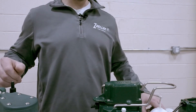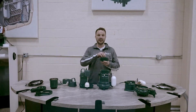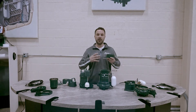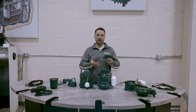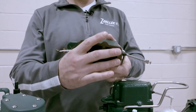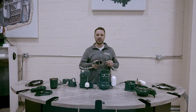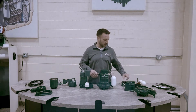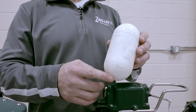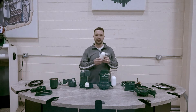When we move over to our Model 53 and our core product offering, we use a fully cast iron cap, acting as one large heat sink. As the pump generates heat, it draws that heat from the motor housing up into the cap, and the water around the pump cools that cast iron very efficiently. We also utilize a snap action switch that we've been using since the 80s — tried and tested over a million cycles. This switch is inside the cap, out of all the elements. On our core product offering we also use a solid polypropylene float, so it can't take on any water if it were to crack and would never lose its buoyancy.